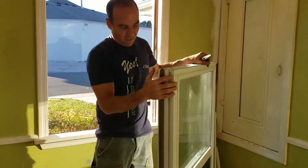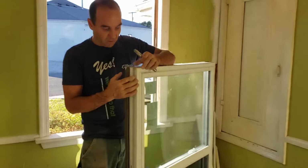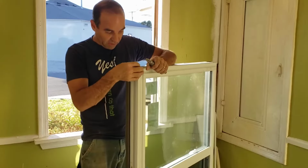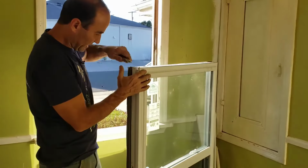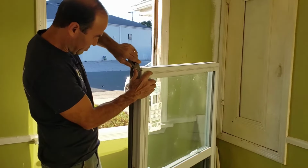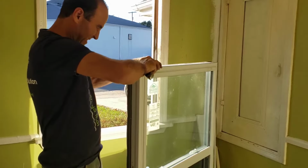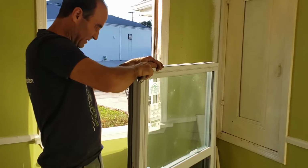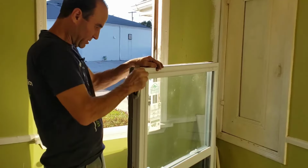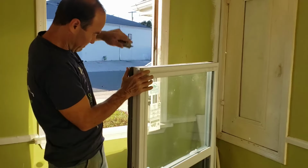All right, so one thing that often happens is when they fuse these vinyl pieces together for the window, they get a little excess plastic around the corners. And I think that's a big part of where we're hitting. It's not the whole thing, but I think we can persuade the rest of it to go in. Ideally, you don't want to put pressure on a window, but this can handle a little pressure. So we trim this off. Let's see what we get.